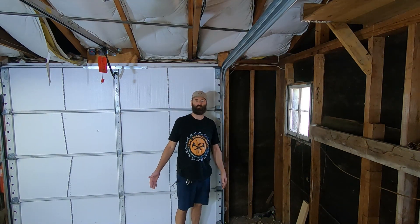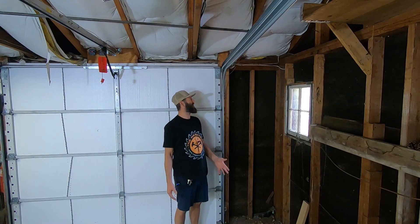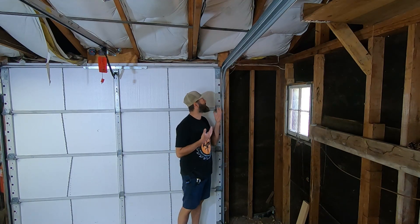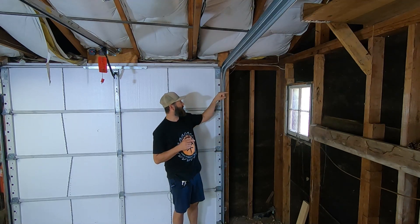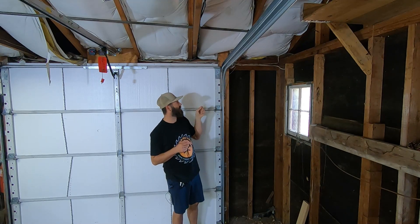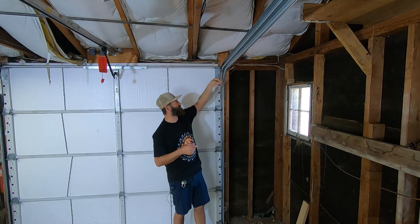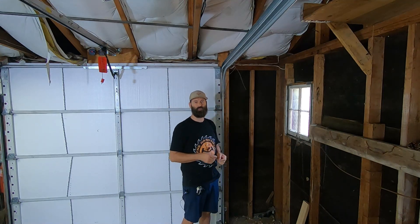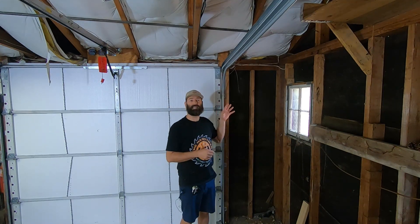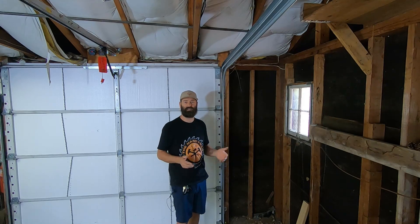Welcome back, you're watching the number one home improvement YouTube channel in the entire world. Today I'm standing next to a booby trap, a death trap. This wire here — its intention is to hold tension, but it's starting to fray and come apart. I'll bring you in close so you can see what to look for on your garage. Ideally you wouldn't let it get this far, because we now have very few strands left. This thing can come unleashed and you could kill somebody.